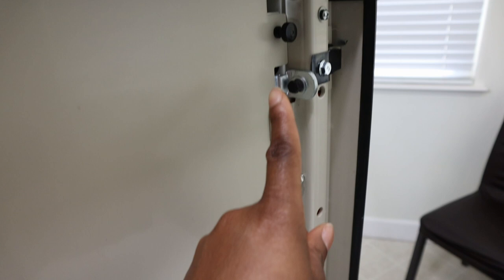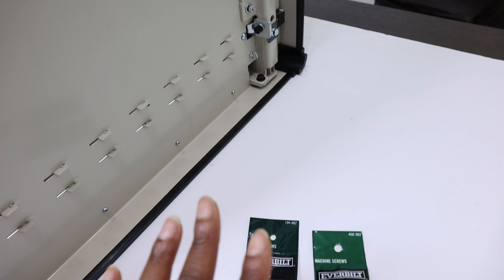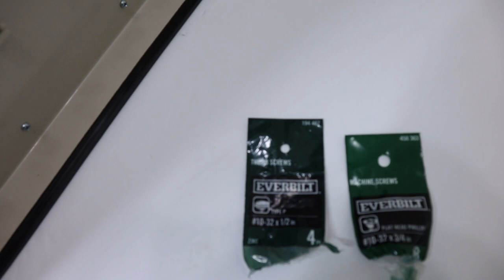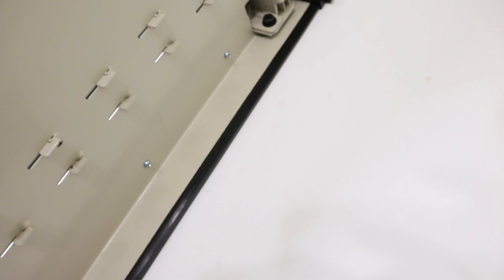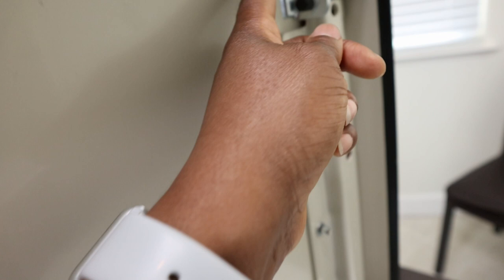These are the thumb screws at the base of the machine. My second one is different from the one that originally came with the machine. The website does mention that when you first get your machine, check for any missing parts. My husband took the thumb screw to a local hardware store and was able to thread it into a device there and replace it with a matching size. The replacement thumb screw alone doesn't give enough tightness, but adding the nut from the original Phillips screw enables you to get a closer grip.